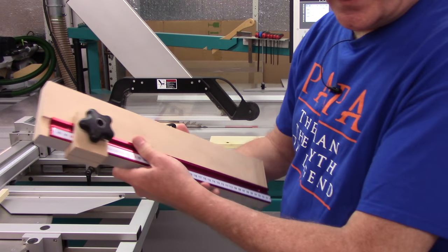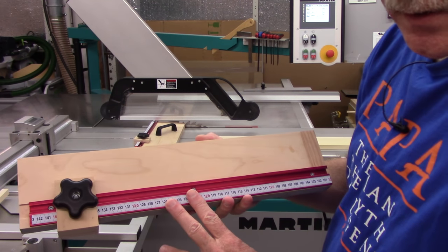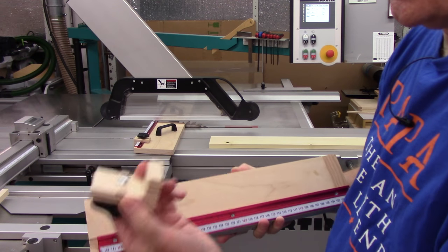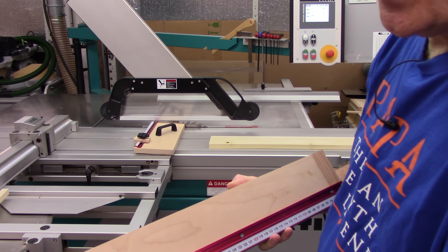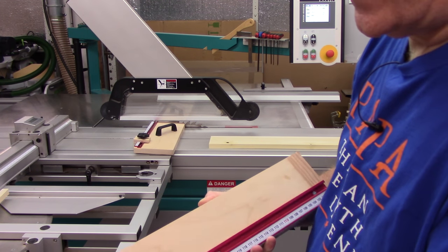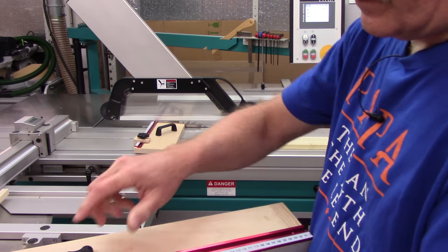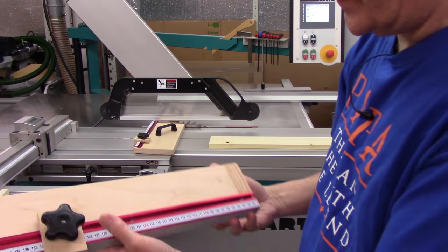The Fritz and Franz jig is a two-piece jig. I have positioned T-tracks on this, and the video shows how I did that. It did not show making these stops — it's just made out of Baltic birch and some maple, a quarter-twenty hex head nut, and a lock star locking handle. I'm really surprised how smooth it is and how easy it is to use.